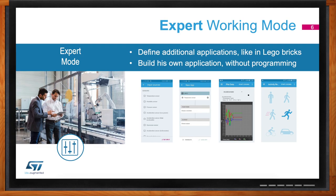Does someone need to perform any C programming to use the expert mode? At this moment, there is no need for C programming — all the customization and programming is done directly through the mobile app interface. In terms of settings you can adjust: output data rates, full scale, filtering of each selected sensor if available. You can also add a wide range of features such as FFT, minimum, maximum, and average values, and many more. The expert mode really gives you enough to customize and configure the sensors as you want. The user interface of the mobile app will have an output button where you select BLE, USB, or micro SD card — all these outputs are available when developing your expert mode implementation.